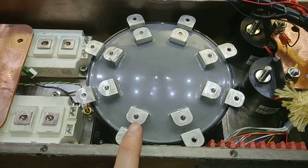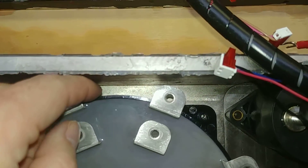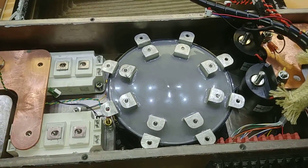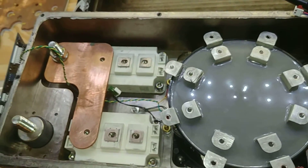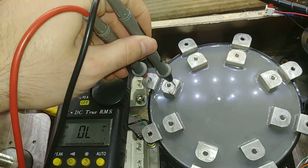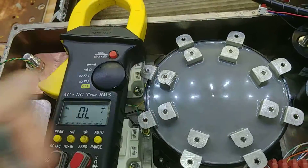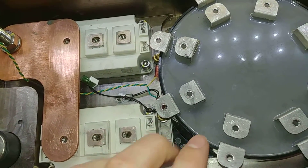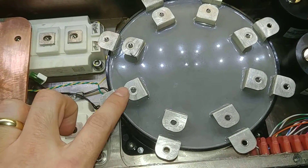Next we've got a ginormous 600-volt capacitor. I don't know how many microfarads it is because the label is down here and I can just read that it says 600 volts. But it's huge. They're all in parallel - the inner ring and the outer ring. I put a piece of solder shorting it out just because large electrolytics like this can build up a charge on their own, just the way the electrolyte stores charge, and if you accidentally come across it it could zap you.